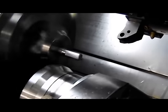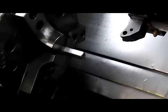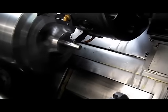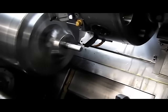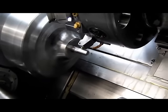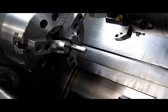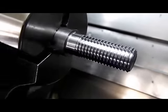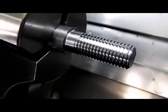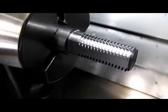The workpiece and the cutter are rotated synchronously with a defined rotation frequency ratio. This frequency ratio is maintained by synchronously controlling the spindle motor and the rotary tool motor. M codes are established in flat turning mode to set the ratio between the rotary tool spindle and the main spindle.